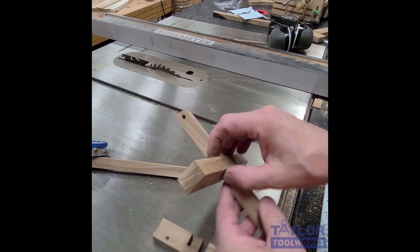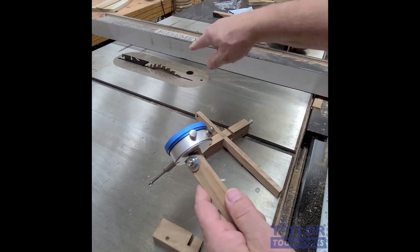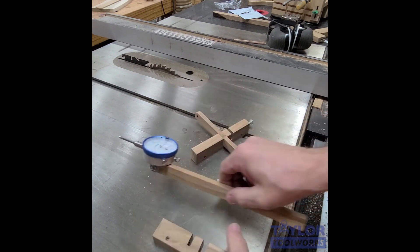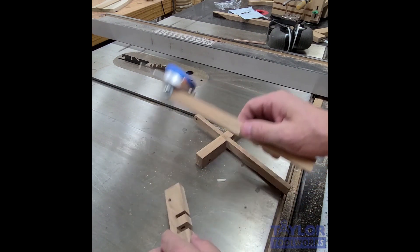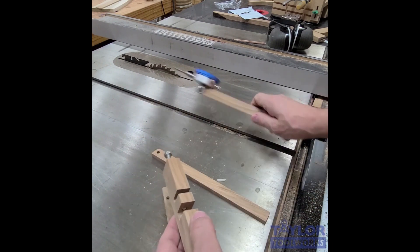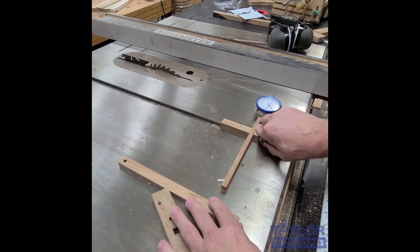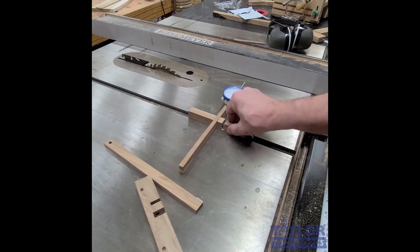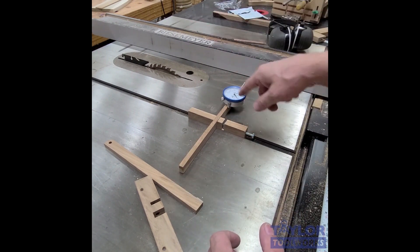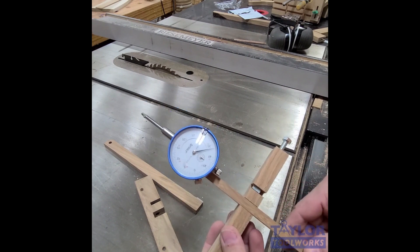There's a quarter-inch hole in the end where I attach the dial indicator, with a rounded top that allows it to tip if needed — useful for checking the arbor or flange on the table saw. This simple shop-made device lets you quickly check fence alignment and blade alignment. I put it in the miter slot and it slides forward and back with no play and no tipping, making alignment adjustments easy. Really important to have a dial indicator in your shop for aligning your table saw.